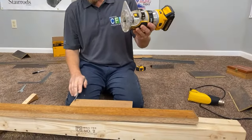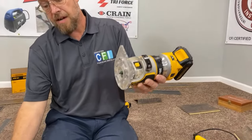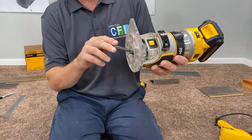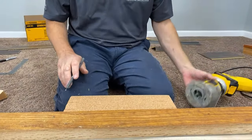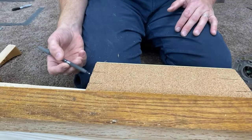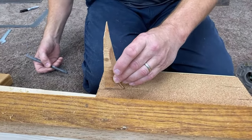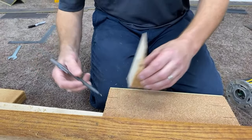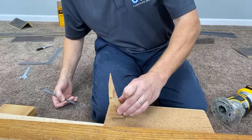You want the actual V cut to land somewhere right in there — with the side of your router on the outside of these marks — because that's the perfect distance for it to wrap right over the step. If you cut right on the marks you're going to be about a quarter inch too tight to fit over. You've got to leave all the material between those two marks because that fits in perfectly.